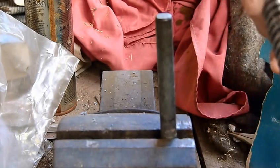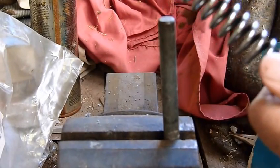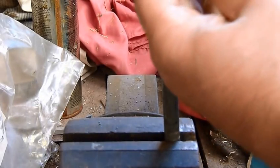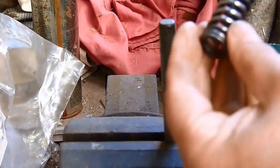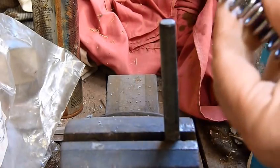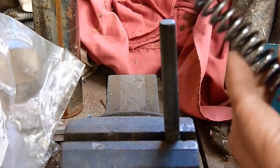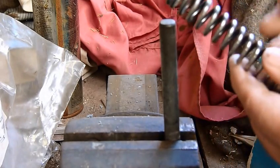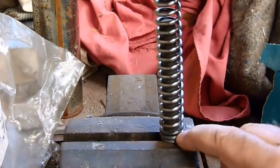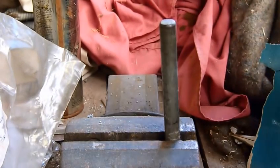So what you've got to do to get that kind of flexibility is you've got to temper it. Now I'm not suggesting that you need to temper this, simply because now that that's squashed down it's not an effective part of a spring - it's just a bent bit of metal at the bottom. Once you've done that, you're done. Don't think about anything else, because you've just created a bit of dead metal at the bottom. All this is still spring steel, but you've got to be careful when you're heat treating this stuff.